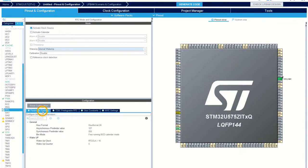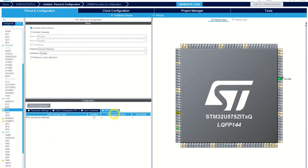We need to set some parameters. Go down to the configuration window parameter settings. In the wake-up clock we can choose one Hertz — two seconds — because we want to wake up every two seconds so we have time to measure. Change the wake-up counter to two. In the NVIC settings we also need to enable the checkbox. So now we have done the configuration we need.